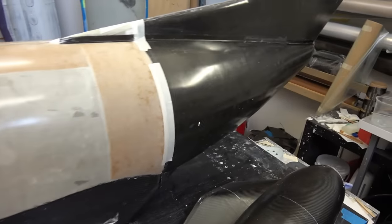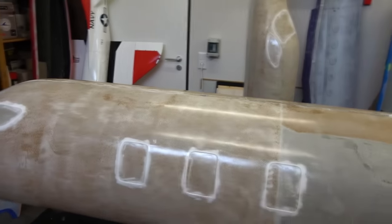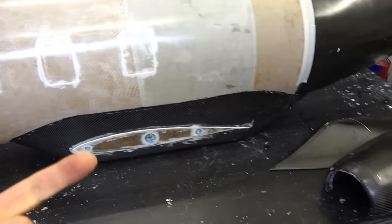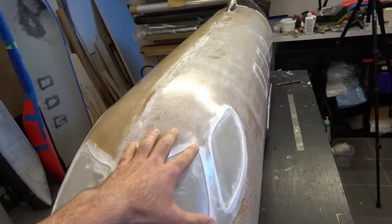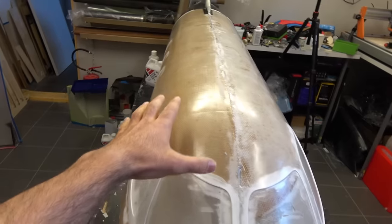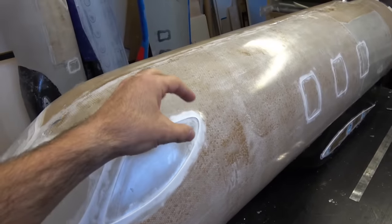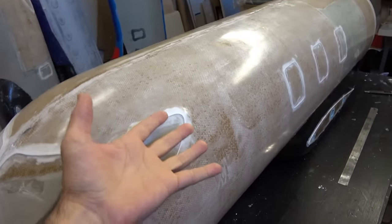The fuselage is complete. Of course I need to sand this whole thing, sanding primer until I get it perfectly smooth for vinyl or maybe paint, I don't know. So here you see that this was the first cast and this is the second one, and this one looks much better, and that's because here I used micro balloons and micro spheres mixed with normal casting resin.